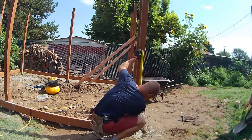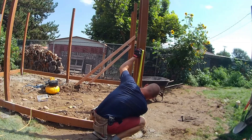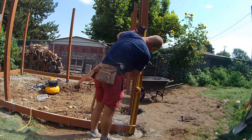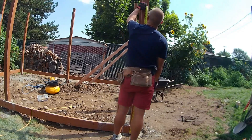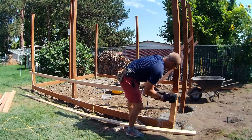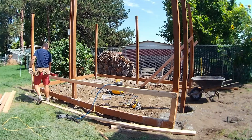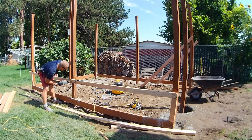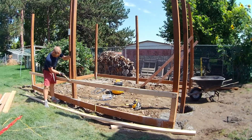I put some angled braces to hold them plumb and level. It ended up mostly good — not perfect, but pretty dang good for one person. Wood's not perfect either, so as I went up and noticed things were out of whack, I was able to bend and work things into place to get a pretty square, plumb, and level building. The strapping went on about every two feet.